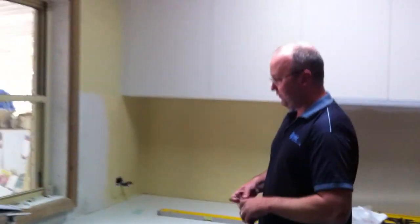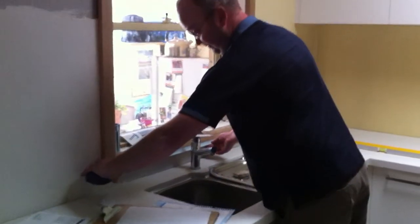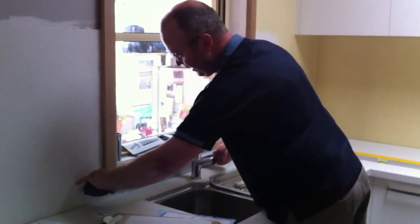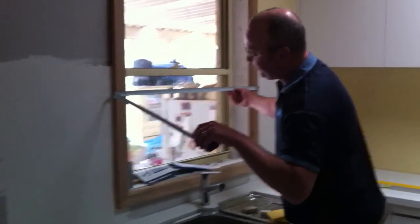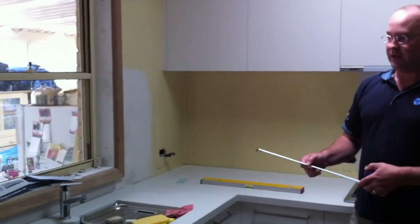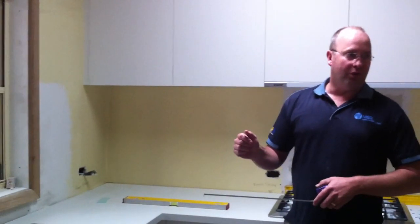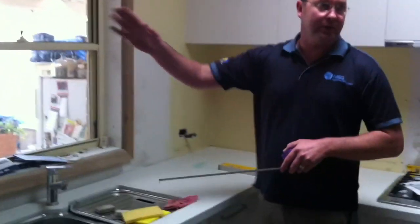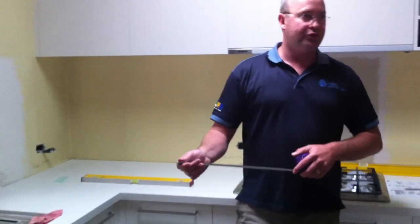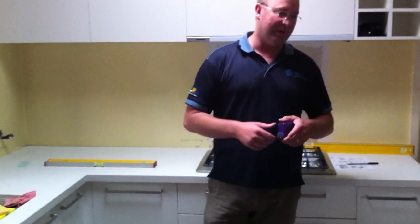In this situation, it's opposite. So imagine being the glass, you want clearance of 2.5 mil on either side of the architrave. So we need to add material as opposed to deduct. So at 1051, we want to make that 1056 as the cutout size. And obviously you need to level it all off and make sure that it's the same measurement there, which is not, it's 49. So we need to find our 2 mil and create that 2 mil shape so it follows the arc line. If it's 1 mil and 1 mil, ignore it, you won't get it. You'll only get 2 or more. In this situation where it is 1 on 1, you'd probably make, rather than adding 5, you might add 6, so you end up with clearance. So 2 mil, anything over 2 mil out of whack, and then you draw it to suit. Generally, 3 is sort of the industry standard. A healthy 2. If it's sort of getting up near 2, maybe ignore it, but a healthy 2, 2.5, put it in, for the optimum fit.